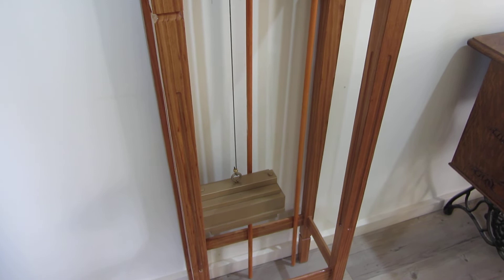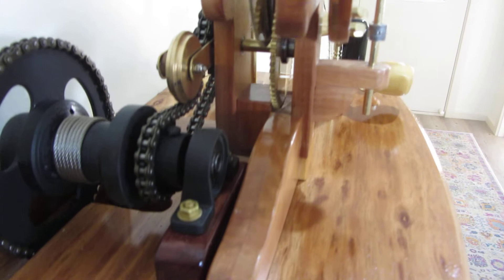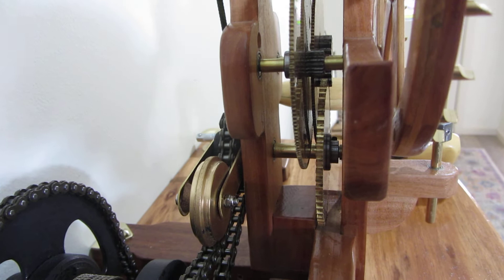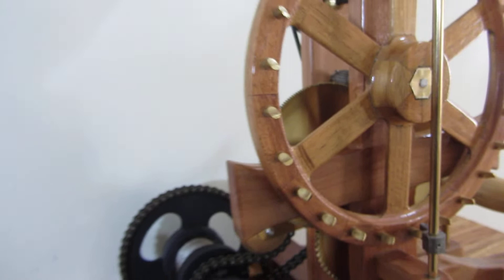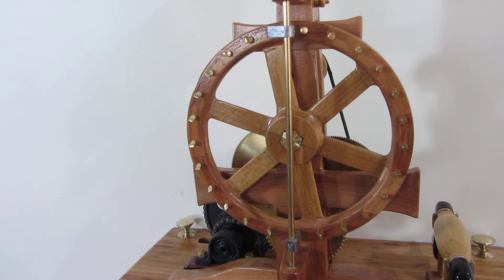I'm hand-holding this little camera so it's a little bit shaky, sorry about that. We're using nine kilos to power it, so it's fairly hungry in that sense, and we're putting it through a 500:1 gearbox. The gear train begins with some H25 chain, which I find really nice, accurate and strong, and then I've cut brass and steel gears to put it through 500 to 1, and that's transferred to the foliot wheel.